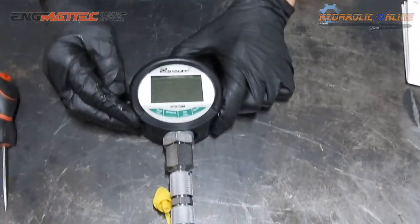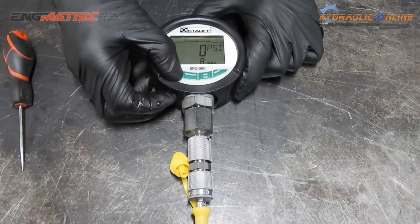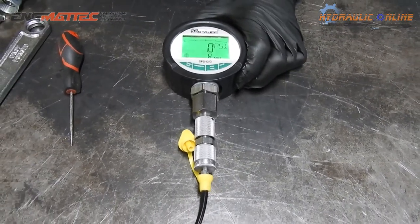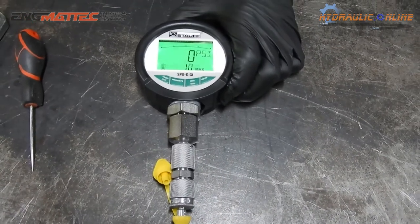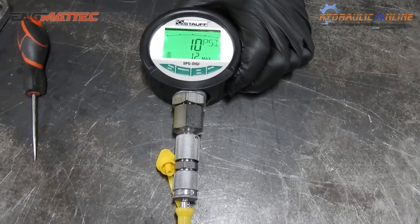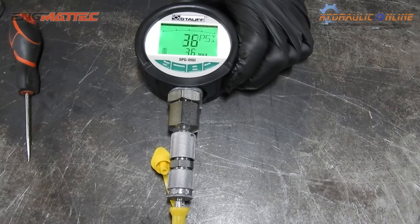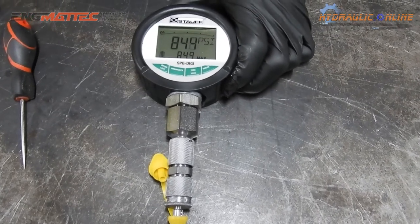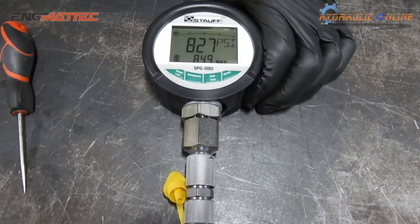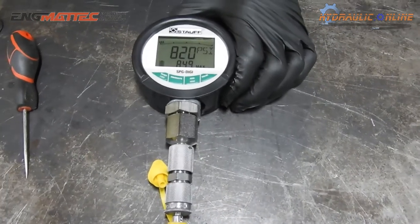We'll turn it on. Goes through its test cycle. We'll put the backlight on as well, so you can see what's going on, and we'll pressurize the press. You won't see anything initially. So it's got 10 psi of oil pressure going through the hose. So you see the light? The light will actually turn off after 20 seconds. Can you see that all right? Yeah. So, 800 psi, pressure will increase quite rapidly, so we need to be careful.